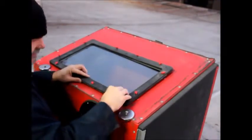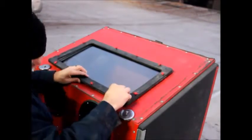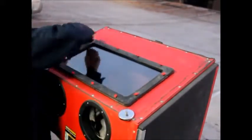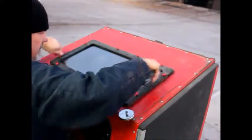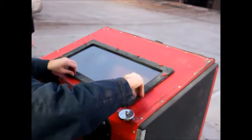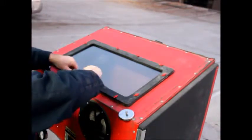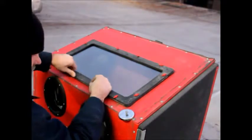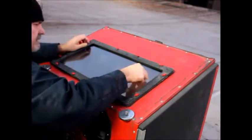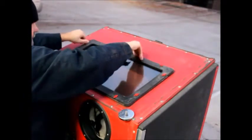I've put these magnets here just to make sure they don't come off when I do this. Just line up the holes — these are the riv nuts all the way around, so just take these red deals here and line them up. On my previous video I said that you could go to Home Depot and buy glass already cut. Well, it used to work, but about two to three weeks ago my Home Depot said they will no longer cut the glass for you. So what I did on this last run is I just bought a piece of 24 inch by 36 inch glass. What you need is 24 inch by 12 inch. I just bought a little $10 glass cutter.